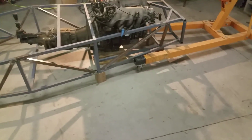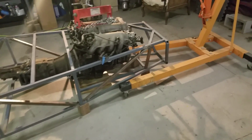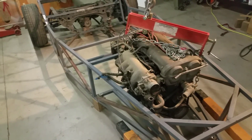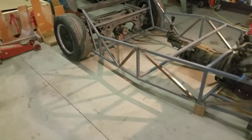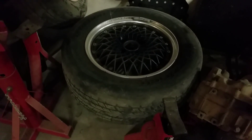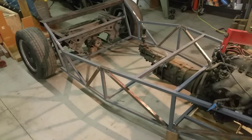I do need to buy front suspension parts. I'm going to buy Jack's from Kinetic up in Oregon — I'm going to buy his suspension parts and get that started. This is a 1.8 from a 94 Miata that I tore apart, and that is a Torsen limited slip in the back, which I bought that whole car for like $1,000. I drove it home, sold all the parts off, I think I ended up making money, and I kept the whole drivetrain. The wheels are from a BMW E30 that I parted out — those are NK92s, and the other two are some brand called Superlight. The offset and measurements are almost exactly the same — about three millimeters difference — so I'll use those until I can buy some that are made for it.